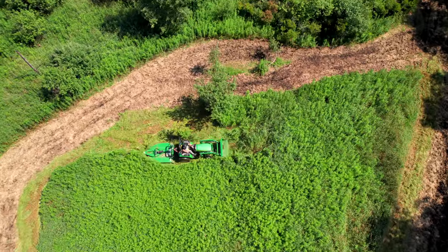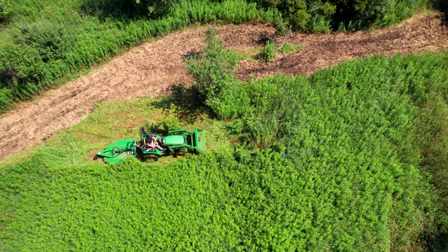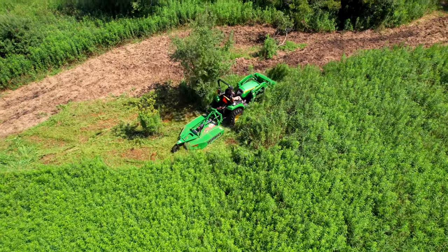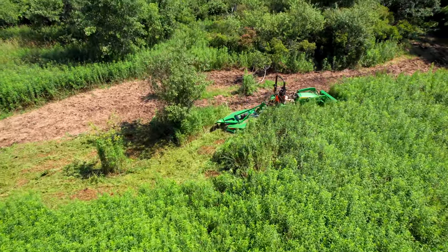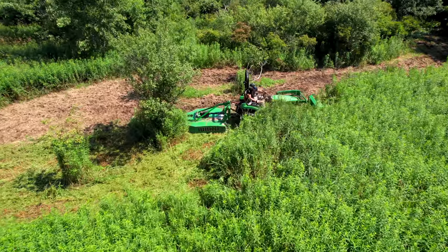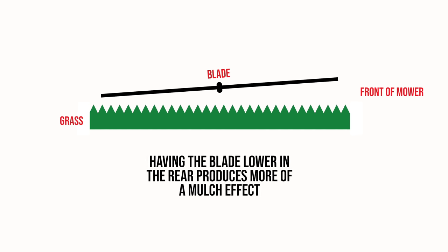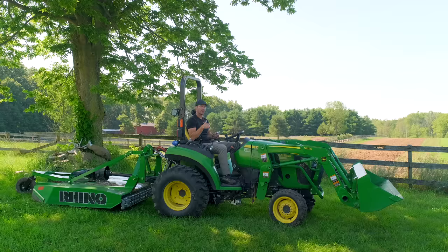There are two angles — a forward and a rear leaning angle — that you can do with your brush hog. If you want the most fuel-efficient cut and least horsepower draw, put the front leading end of your brush hog about an inch lower compared to the rear discharge side, which should be about an inch higher. The flip side: if you raise the front an inch higher and lower the back an inch, that allows debris to cut multiple times, giving you a finer chop and more evenly dispersed material flow instead of the windrows you often see with brush hogs.